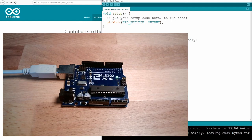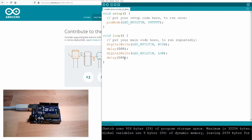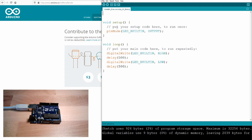If I want to change it again, I again have to change those two values. I do not want to change two values always. Therefore, we can introduce constants, yeah? Compile time constants. Those constants can be defined by hashtag define, and then I need to give a name, LED on off time, and I have to write a number, 200.